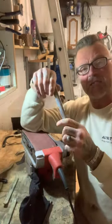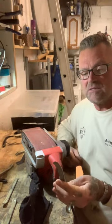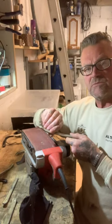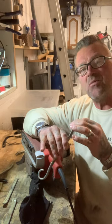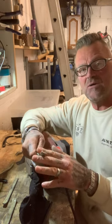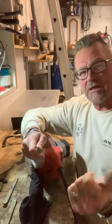The way you do it, you can file it with a metal file, or I use a belt sander because it's quicker and easier. So you rework the tool — you can rework it I don't know how many times — until this piece of metal becomes too thin. When it's too thin, cut it off with a hacksaw or a grinder, a little four-inch grinder with a metal blade. Cut that bit off.